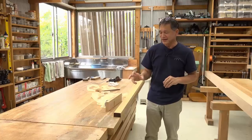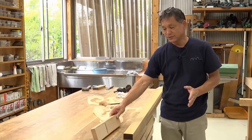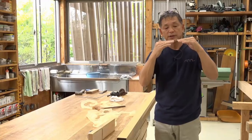Using a hand plane of this width, you cannot plane an entire pillar's width in one pass — it's necessary to plane in two or three passes. If you sharpen a wide plane blade's cutting edge straight, you can flatten a 120 mm width in one pass. However, when using a sunpachi-sized plane with a blade width of about 72 mm, you'll need two passes, which can create bumps or a slanted surface. To minimize such irregularities, I need to plane as thinly as possible. Even so, the resulting bumps are only one or two microns — so fine you can hardly feel them by hand.